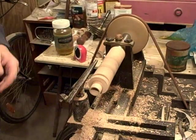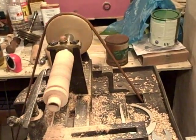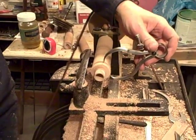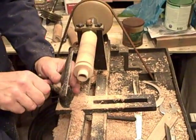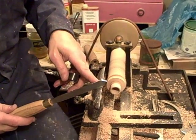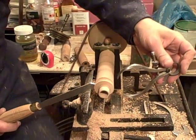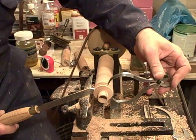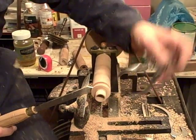So what I'll do now is take this lid down — I want to take that down to 32. Just keep this spinning round while I slip over and get my other caliper that's been set. Oh, amazing isn't it how much inertia there is in this wheel, that it keeps going like that. Okay, so guys, there are my parting chisel. Obviously you won't want to reach over like that if this is a power lathe — no worries with this one, as I said before. So, care for your health and safety.